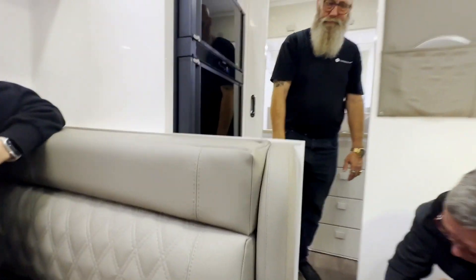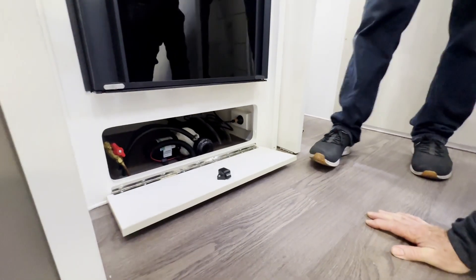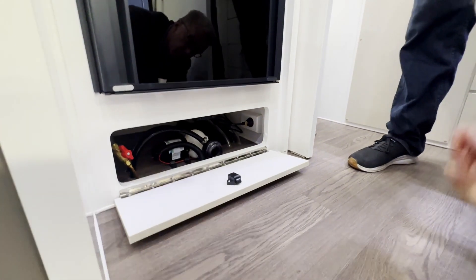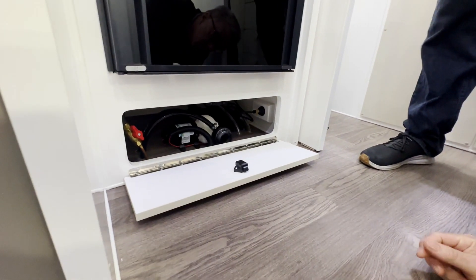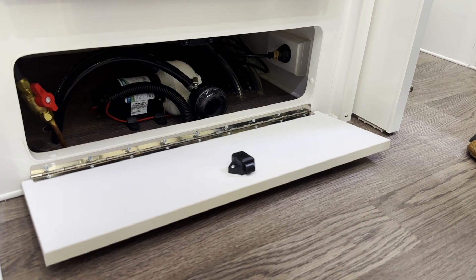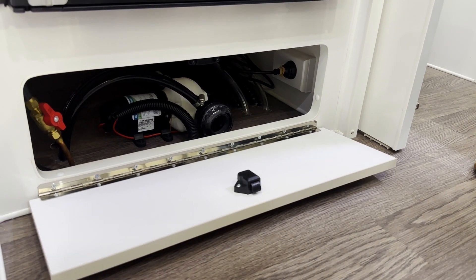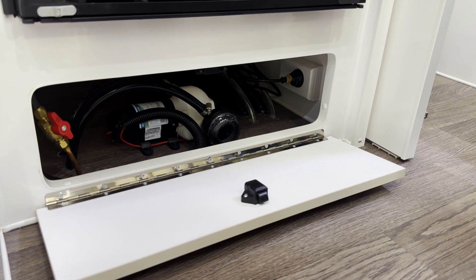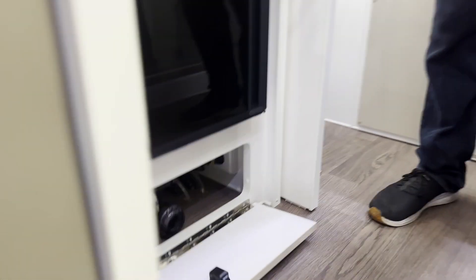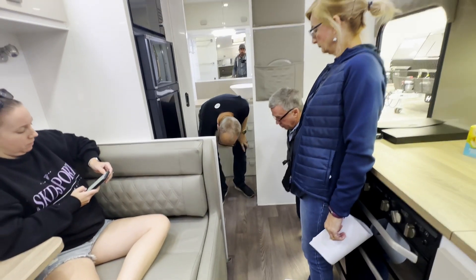Underneath here is the water pump. On the pump there's a little bowl which is a pre-filter screen — if any muck gets into the tank, there's a little mesh in there that stops any big lumps from going through your pump and water systems. If your taps flow slowly when on the tanks, come and pull that cover off, clean out the mesh, and allow it to flow again.